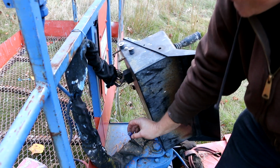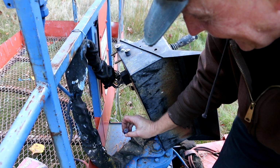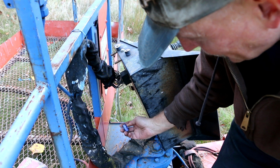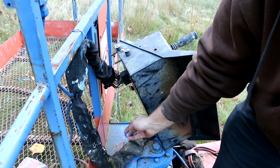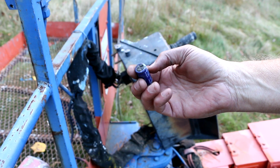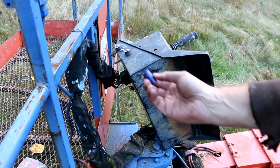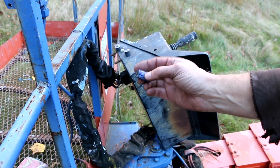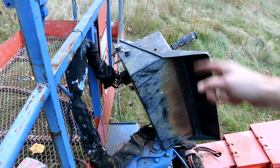And this electrolytic capacitor just fell out of here. And yeah, there are no leads on it. So this probably came off of the PC board. Now if I open it up and there isn't a new one on there, which I kind of doubt. I mean, why would you leave this? Why would you break this off the board and then just put a new one in and leave this in there? This is actually good news. This is something I can fix relatively easily, and I wonder whether or not that would make everything start working. Wouldn't that be awesome? But anyways, I got to get this off of here.